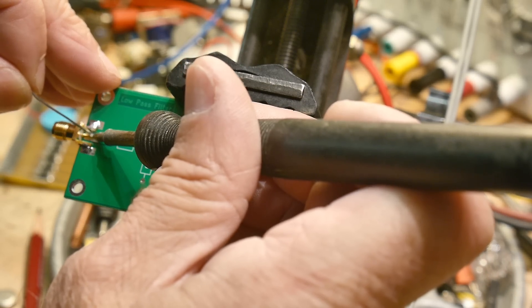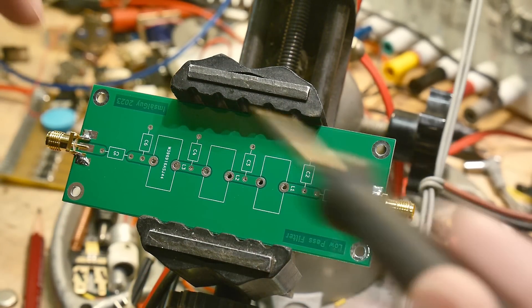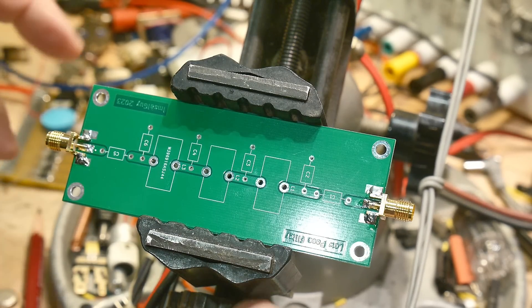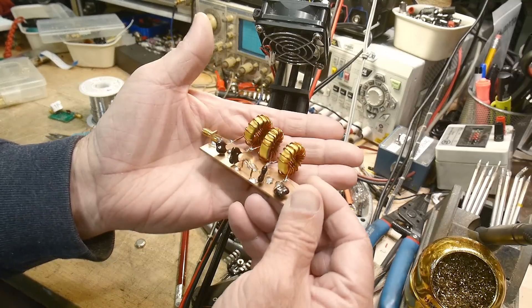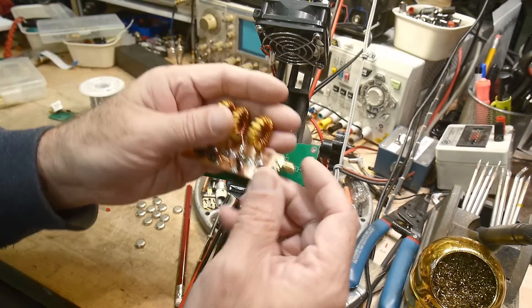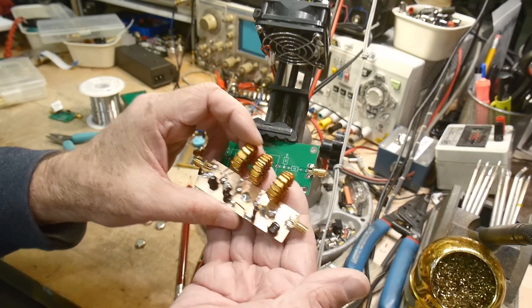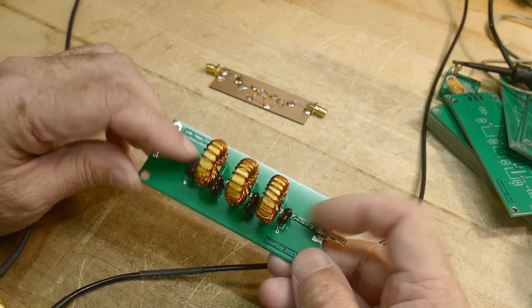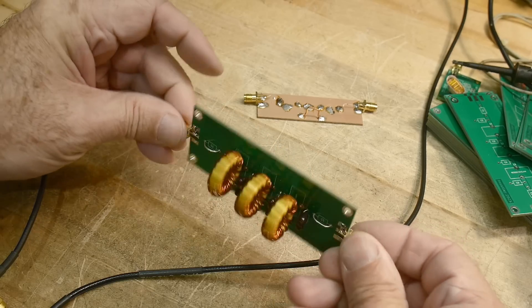The center pins are the trickiest. The first thing I'm going to do is move all the parts off of this breadboard — this is my low-pass filter that I did — and put them all onto the PC board to make it look pretty. I'll call this the prototype and this the alpha unit. This was a 40-meter low-pass filter, so I'll just move everything over. I didn't need the input and output capacitors, so there are just wires there.